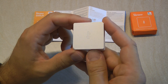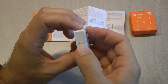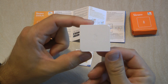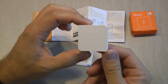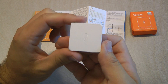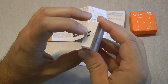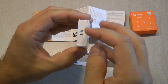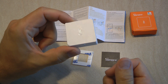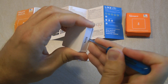It looks like this device is mostly asleep to conserve battery power, waking up maybe once a minute or every 30 seconds to take a measurement and send it over Zigbee, then going back to sleep. That operation doesn't seem to be influenced by the button, so I think the button is only for pairing. There is no way I could find to influence the metering interval, but for a temperature sensor even five minutes would probably be fine. There are no contact surfaces, so you can't use it to measure fluids or other bodies — it's really designed to measure ambient air temperature through those vents.